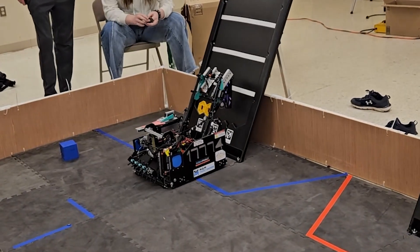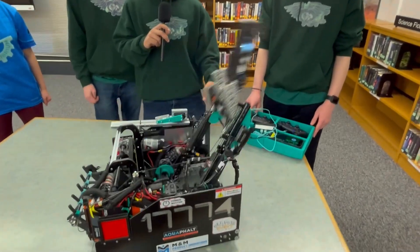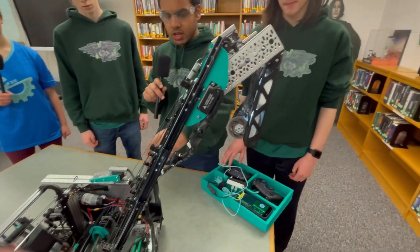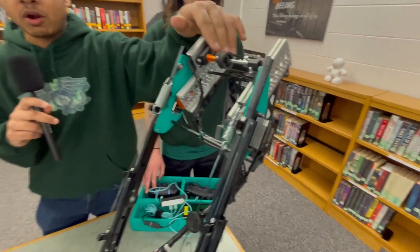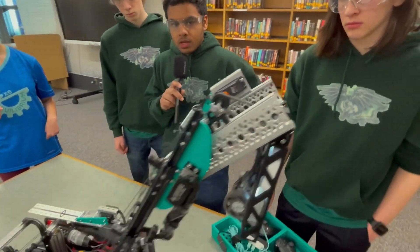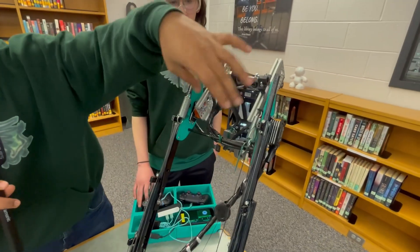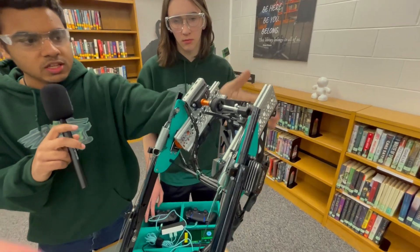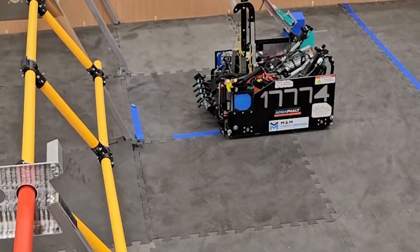Once you have the pixels in your robot, how do you get them onto the backdrop? So we actually have a three-degree-of-freedom arm — we raise it up, this goes back, and it sits just about parallel to the board. Our slides are actually at 30 degrees. We have two servos to power the arm and then we have this box here that's powered by one servo. We have two Axon Max's that power this arm — it rotates this way — and then we have a belt that's linked to this box. When this servo spins, it's just a REV smart servo, and it rotates this box forward and backwards.